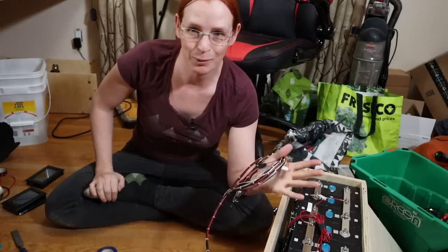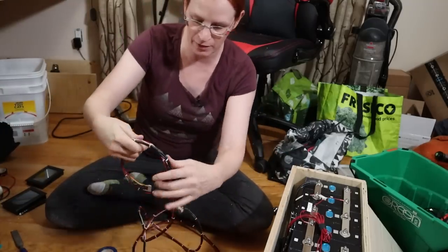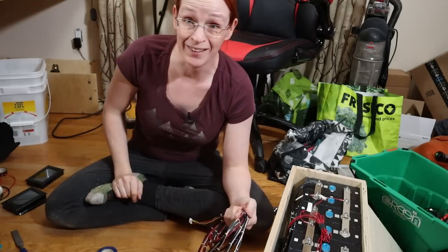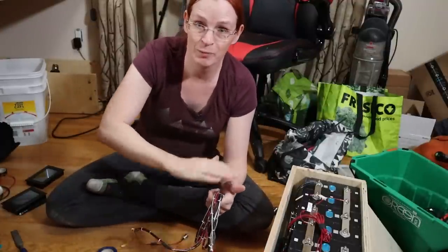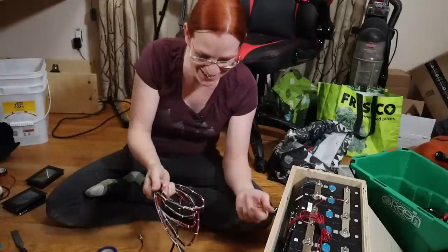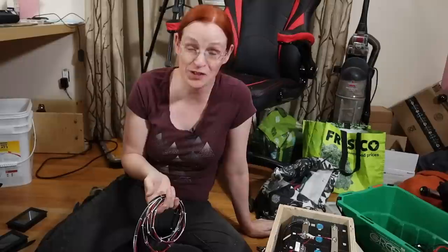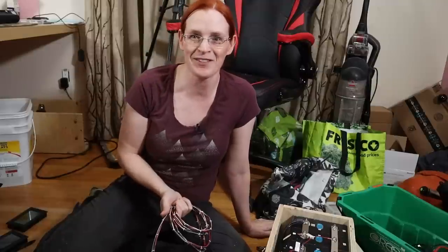I think this is a much prettier cable harness and much more manageable. You saw how messy it was before and how they were tangling with each other. It doesn't take that long — compared to using zip ties, yeah it takes longer, but the other thing that's really nice is that anyone who's ever used zip ties knows that when you cut the end they're super sharp and you slice up your arm fishing something out. This doesn't cut you — it's just better in every way. So that was, by my standards, a nice short little video on the mostly lost art of cable lacing. I'm sure there are some people who are still quite the aficionados and can do better than me, but I'm very happy with what I can do considering I taught myself. I'm The Digital Mermaid — thank you for watching!